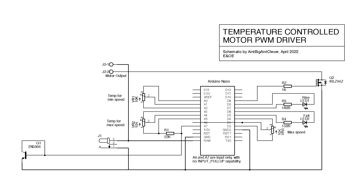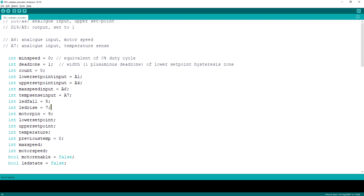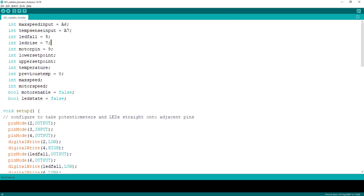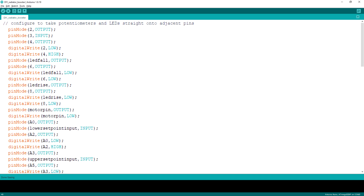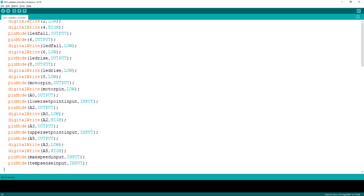I've designed this with the variable resistors wired with all three legs going to the Arduino. This is just to make it easier to assemble, as instead of providing supply and ground connections to each resistor, I can just configure the pins either side of the input as outputs and set one high and the other low. Here's the code, and it's in three parts. First of all, we've got some variables, most of which just assign names to the various pins, just to make the code easier to read and alter — for example, if you wanted to swap some pins around. After this, we've got a setup routine. This runs once and is used to set the various pins as inputs or outputs, and whether they're high or low — that's how those variable resistors get the supply at each end.